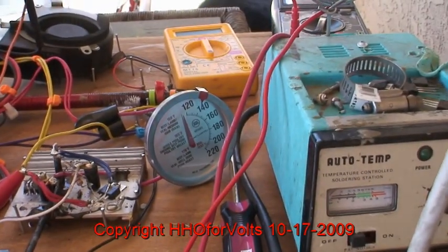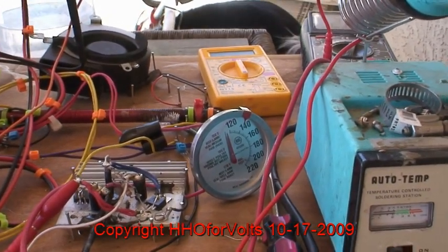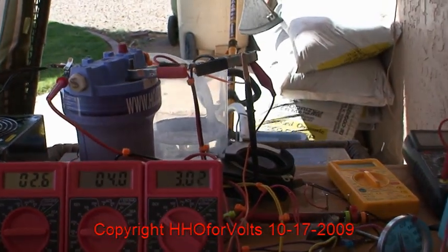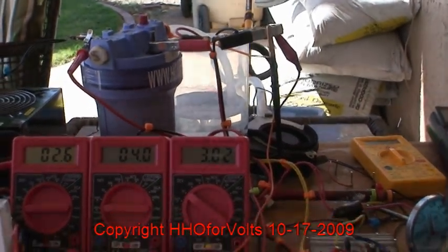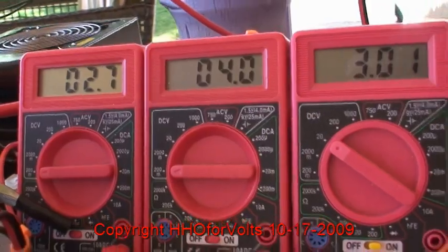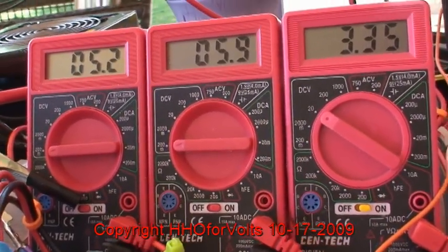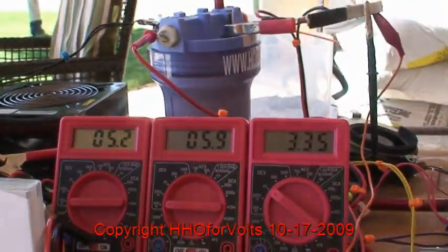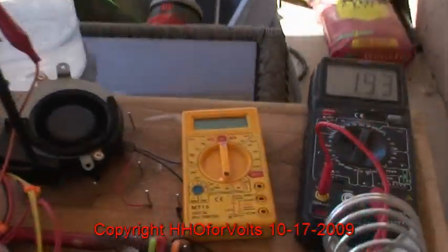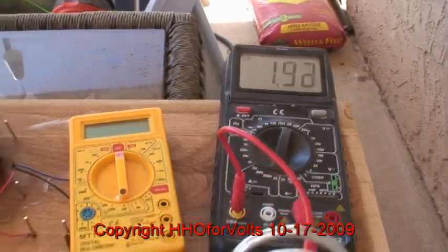There's a tremendous drop in temperature. Bias is 4.74 volts. Amplitude I believe is around 8 — I'll have to check the amplitude when we do the inside scoping on this. If I move the mark space, I can increase current to just about 6. The temperature will go to about 135. That's the damn fast diode current there.